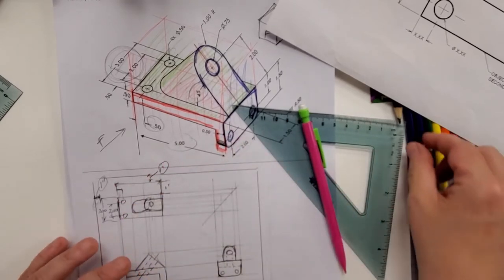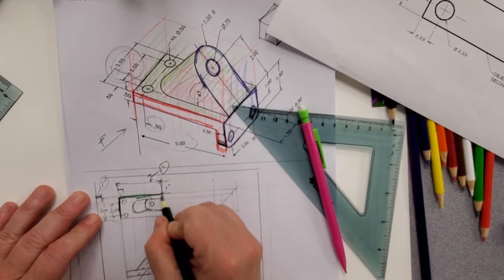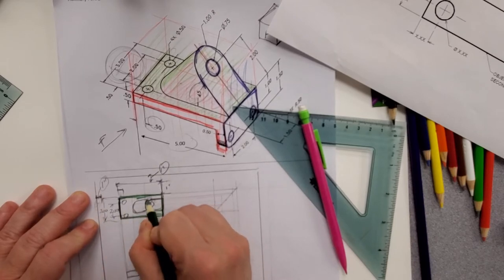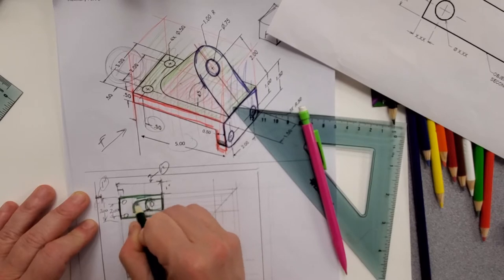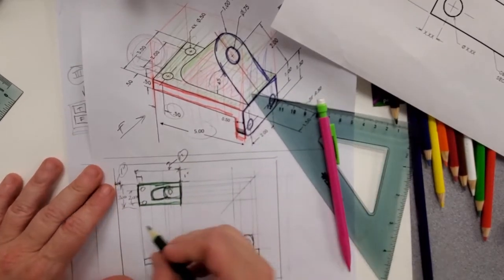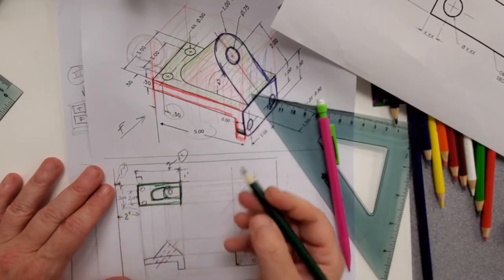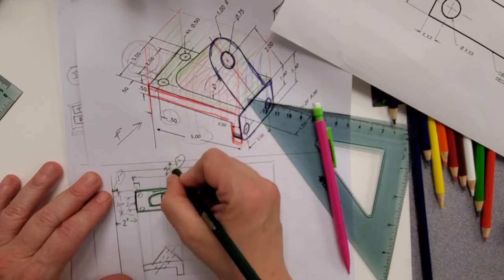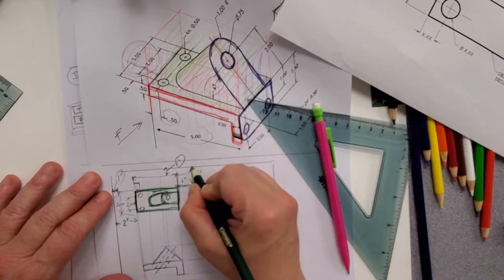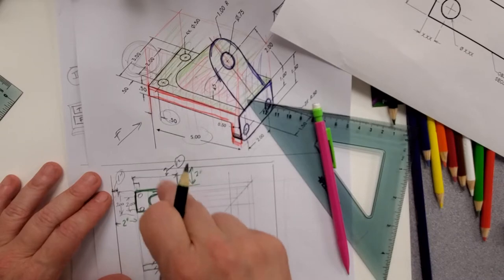So you're going to start your drawing with your object 2 inches in, the actual part, not the dimensions, the part. See that item in green? It's going to be 2 inches in, and if we assume this dimension plan for the top, 2 inches in from the border. Did you hear that? From the border.